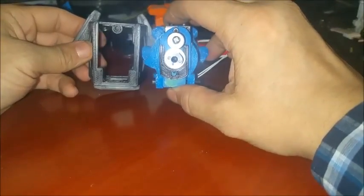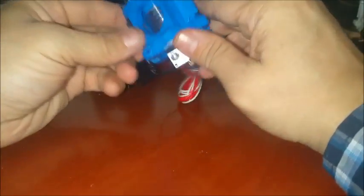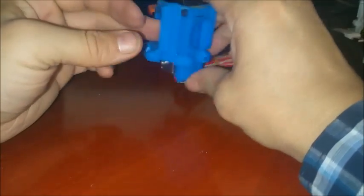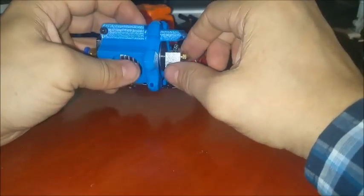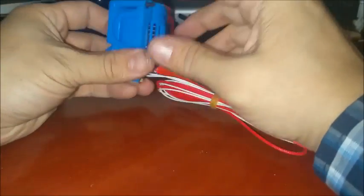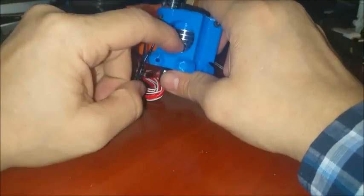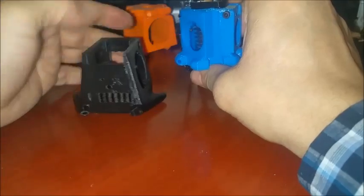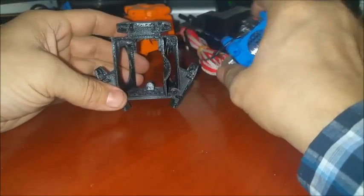It also has an auto level feature. Here is the one I've developed — very compact. Though it requires that you drop down to 30 millimeter cooling for both fans. I don't think anything more than 30 millimeter cooling is necessary for the hotend unless you're going to much higher heat requirement filaments. For PLA and ABS, I don't think anything more than 30 millimeter is necessary for cooling the heat sink as well.